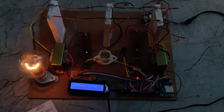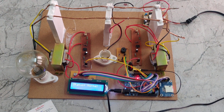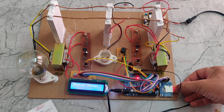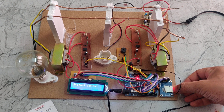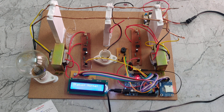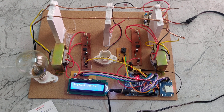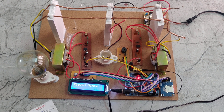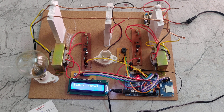One important note: when we power on the Arduino UNO board, we need to check the GSM module's red light indication. If the red light blinks rapidly, it means the module is not connected to the network. If the red light blinks slowly, it means the GSM module is connected to the network and is able to send messages to our registered phone number. The phone number is coded into the microcontroller. This is how the system works. Thanks for watching.